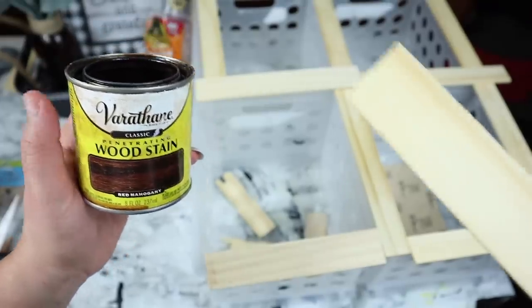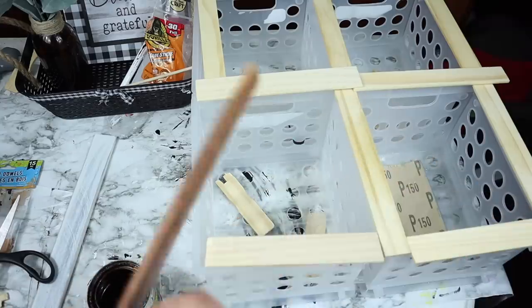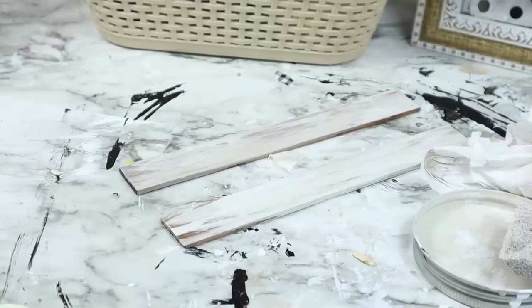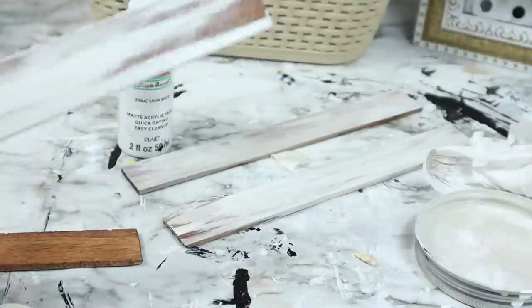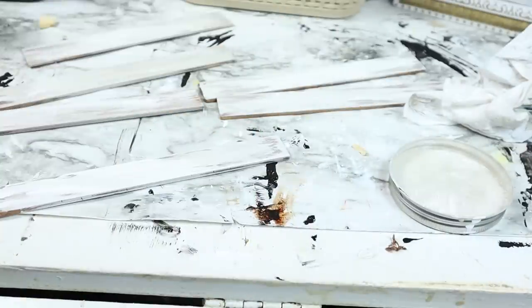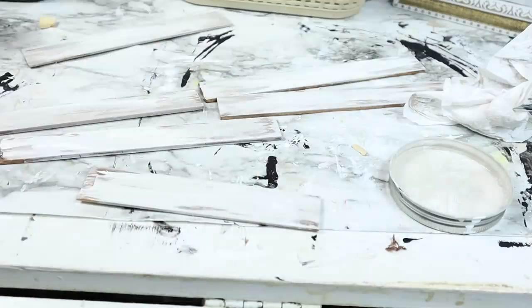If you don't have wood stain, you can use the stain markers from Dollar Tree for the same effect. You want to stain it so we can whitewash it and make it look more aged and worn. Stain every single piece of wood — the front, top, and sides — so none of it shows through. Then we're going to paint it with chalk paint. Once the stain is dry, go in and paint your wood. I wanted mine to look more worn but couldn't find white chalk paint, so I used a more taupey shade mixed with a little water, did a whitewash over the stain, then went in with some white on top to make it brighter. By staining it first, it gives that aged, worn look and I really like how it looks once dry.